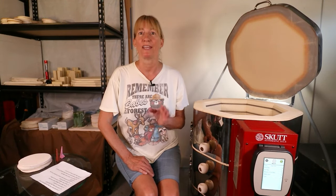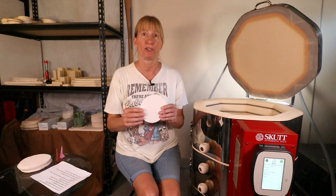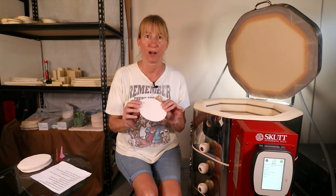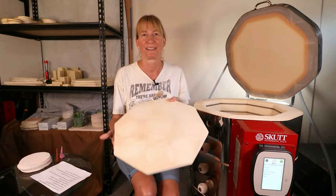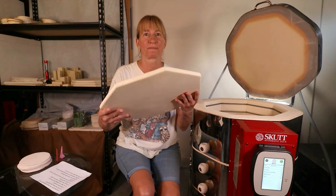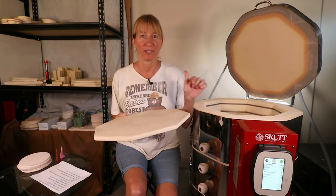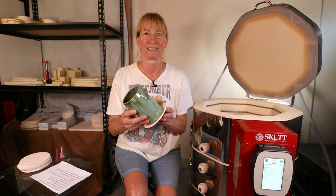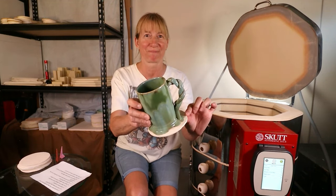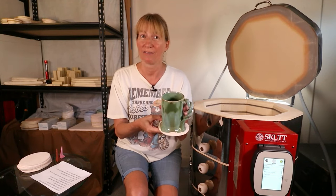Do I have to use kiln wash? If you don't have top-of-the-line kiln shelves or use cookies then I definitely would use kiln wash. If you use cookies, make sure you use cone 10 clay with heavy grog — they last longer and shrink less with the heavy grog. These are my shelves and they still look pretty good. I also have an article for you on protecting your kiln shelf from melting glaze — I left a link in the description below. This is how well the cookies protect your shelf from melting glaze. If I didn't have this cookie I'd have a really hard time getting all that glaze off my shelf even with the kiln wash.